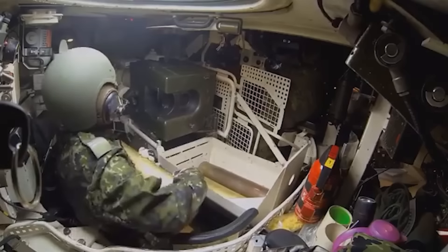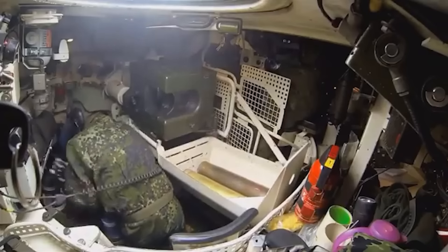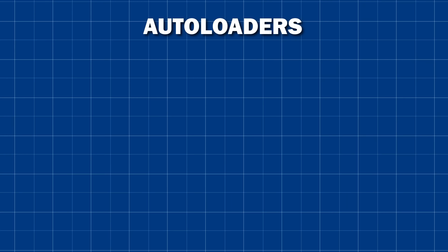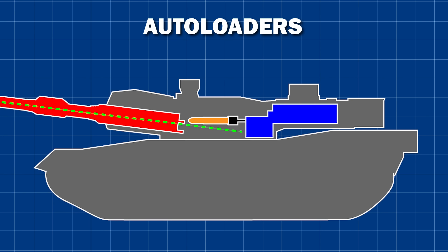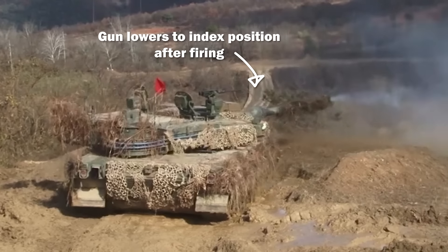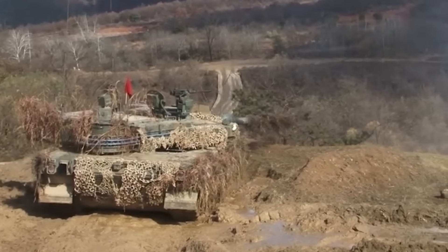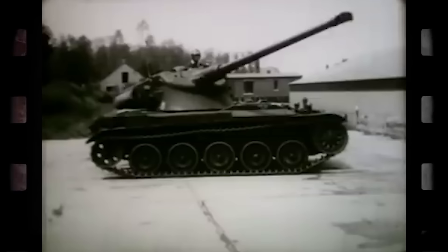The other major advantage of the oscillating turret design concerns loading the gun. The loader is inside the upper turret and so he is moving along with the gun, meaning the breech is in the same relative position to him at all times. But the real kicker is when you want to fit your vehicle with an autoloader — a device that automatically takes rounds from the ammunition stowage and rams them into the gun breech. This works fine in conventional turrets as long as the gun is completely level at zero degrees elevation, or what is known as the index position. But when the gun is elevated away from this index position, the autoloader can struggle. Conventional turrets solve this either by using a more complex autoloader that can load at any elevation, or by bringing the gun back down to the index position between every shot — the first option being expensive, the second not ideal. An oscillating turret provides a neat solution, as the autoloader mounted in the upper turret will be in line with the breech at all times. So a vehicle with an oscillating turret and an autoloader can be small, fast, and pack a big punch.